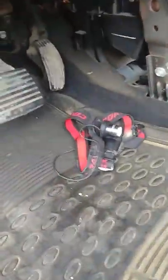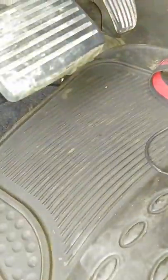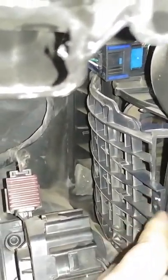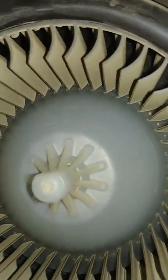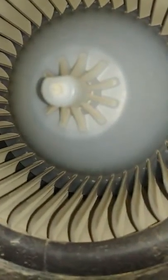Next, what you can do is reach under the driver's side. For my 2013 Dodge Dart, go underneath the driver's side, turn on a light, and right above the gas pedal there's a little grate right there. Take that bolt out with a 5.5 millimeter ratchet and you can reach right in there and actually see the blower motor fan and check to see if it's spinning freely.